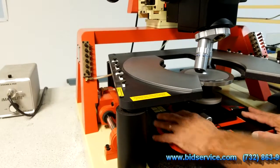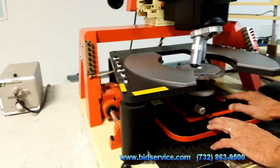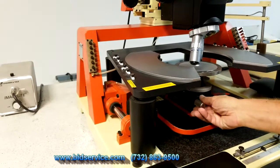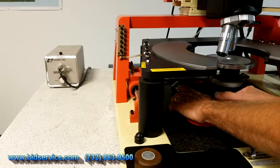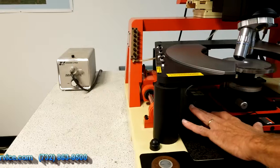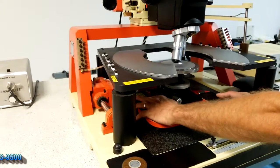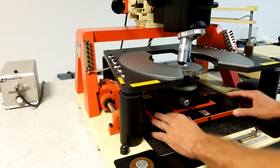Once you find your position, you'll hit stop and the stage is locked again. For fine adjustment, you can use the little wheels on the stage for your X, your Y, and you have a theta adjustment. Finally, there is an X-only mode — so when you want to do your theta adjustment when you're initially aligning your wafer onto the stage, it only moves in the X direction. If you try to push it in Y it won't move. That's the X-only mode. Take that off and again we can reposition, then stop — stage is locked in place.